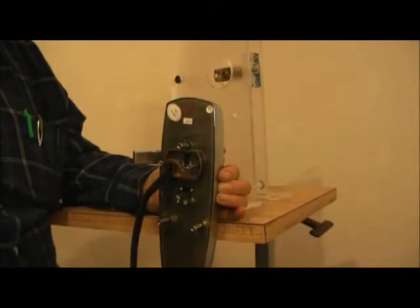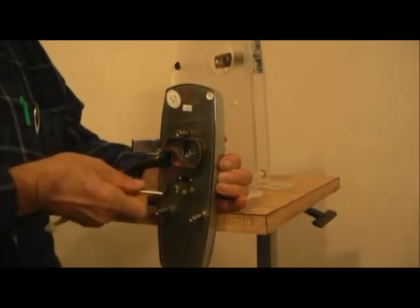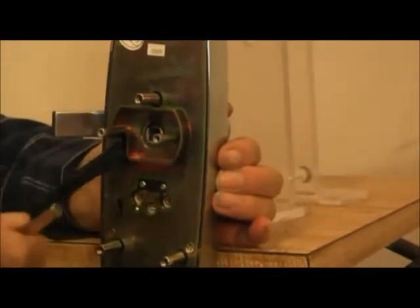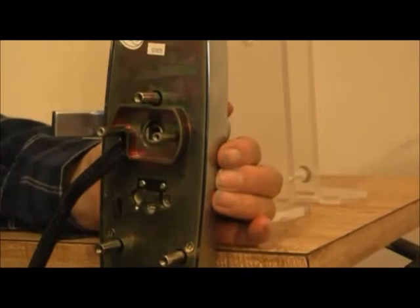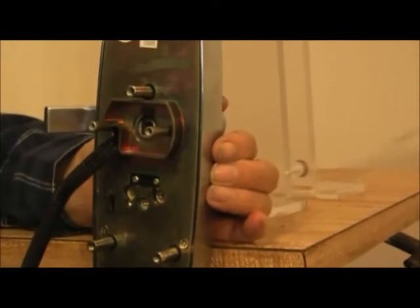This is an extremely important step — take special note. First, we're going to show you what the impact alarm is. Shown here is a metal switch that is the impact alarm. It is on the outside of the lock, under the rubber grommet. The impact alarm must be pressed down before the batteries are inserted. If it is not pressed down before batteries are inserted, the alarm will go off continuously. It's there to prevent the lock from being pried off the door and to tell you if the lock is loose on the door, which means it's more exposed to the elements and can be easily pried off.